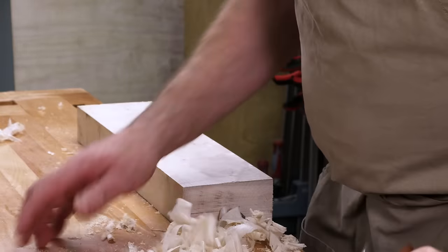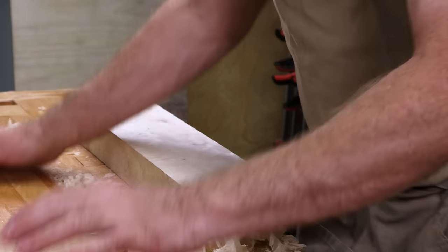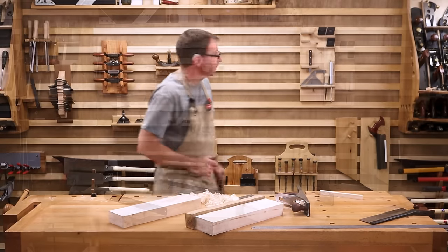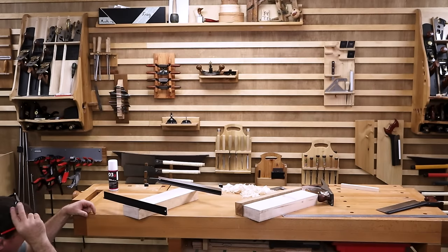Let's just move a few things. Let's slide our boards up a little bit. Hoping we can show you that nicely using the winding sticks. So let's just set that up. So just set the winding sticks up. We've got them parallel, we've got the black, we've got the silver in the background. I'm gonna put my glasses on now. I'm gonna get my head down, just looking at what I get as a line. And they're coming across.